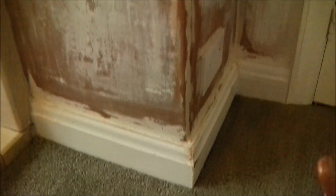An important thing is to make sure you've got no runs on your wall as it's drying, because they can dry in streaks, so that can be a problem. And then when you've done your wall, get your cloth and make sure you wipe all the surfaces around the area where you've PVA'd, because once this stuff goes off you can't actually see it, it dries clear, but because it's a glue, over time all the dirt sticks to it, so then you start seeing black spots everywhere.